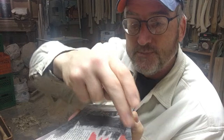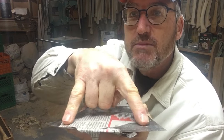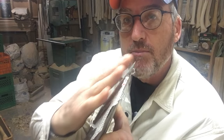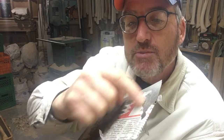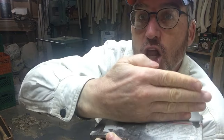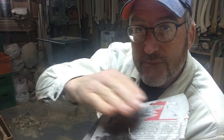What we do — and I'm going to cover it eventually in a video — is we grind out wings. We take out a bunch of metal here on the sides so it doesn't drag. We don't mess around with the chopping edge; we do it back here on the sides. Taking that metal out makes it almost a V in the middle with a lot less metal dragging in the wood. The next thing we do is put a bevel on the edge to create what we call a bust. When the axe bevel goes in the wood, the last place it touches is right there at the bust, and from that bust back you actually want it hollowed out.